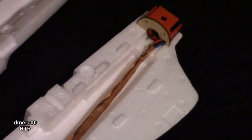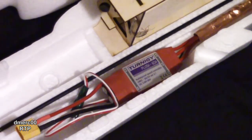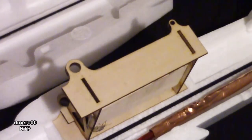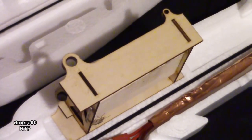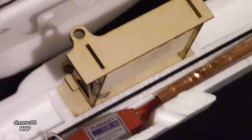Now I know I'm not giving many details — this is just an update. I use the copper foil method to keep the noise from the motor wires from getting into the GPS. I've got that on there, thanks to Tony from Vortexes for that idea. I'm using a 60 amp ESC, and I've built a wooden box instead of a 3D printed box, just to be more in line with what some people are doing — not everyone has a 3D printer.